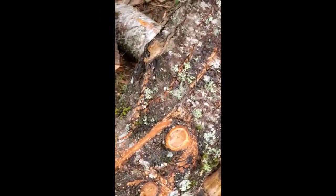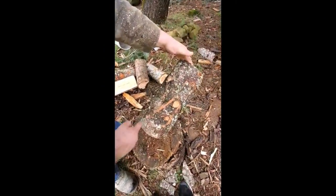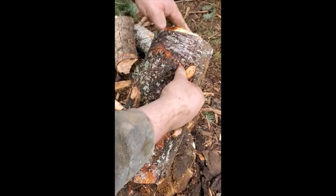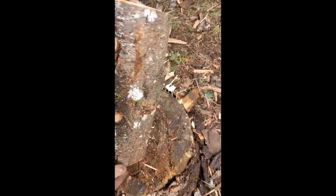Find spots in your piece of wood where there is no knot. So, for example, you're going to shoot right for this line right down here in between them. If you split it again a different way, you got a knot and a knot. So you'd kind of, well, that one kind of goes in. But if you'd split right down here, it would probably split right open. Okay, now zoom in here.